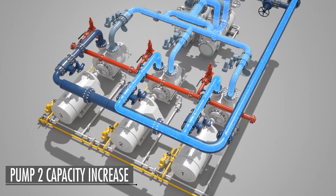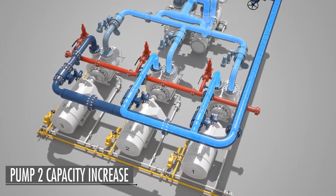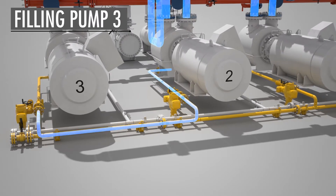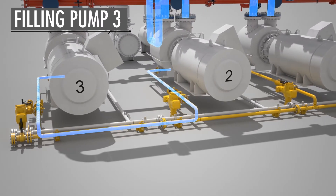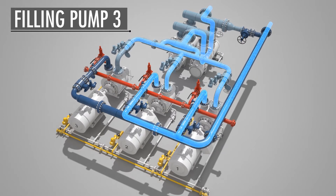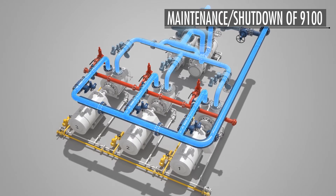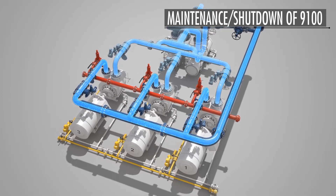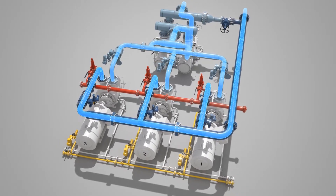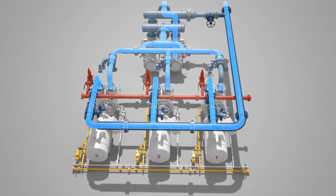When it's time to perform maintenance on one of the two operating pumps in accordance with protocol, the valves and the equalization line for pump three are opened until a sufficient liquid volume is present. Once the liquid level transmitter in pump three sends a signal to the PLC, the inlet and outlet valves for pump three are opened and the pump is energized, placing all three pumps into parallel operation. Temporarily, all three pumps will operate at a reduced speed since speed control is a function of the set drawdown pressure programmed into the PLC. Once the system is stable, pump one can shut down automatically and the inlet and outlet valves to pump one will be closed, leaving pump two and three operating and maintaining flow and pressure.